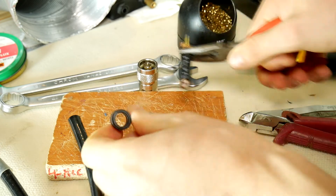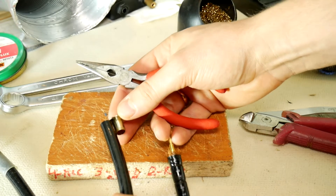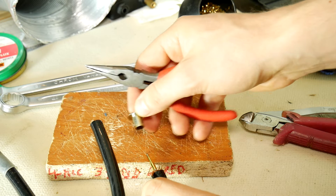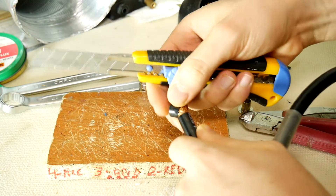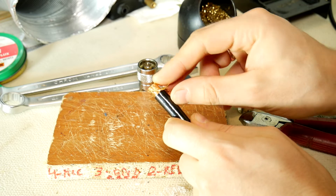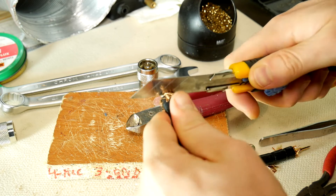Remove the insulating rubber cylinder and place it on the new coaxial cable. Then use the core separating metal cylinder to measure how much rubber shield should be removed. Using a sharp paper knife, carefully remove the outer shield rubber. Then separate the shield screen from the central dielectric insulation, and cut the central dielectric insulation ring almost at the folded edge of the screen.